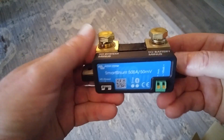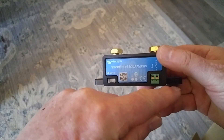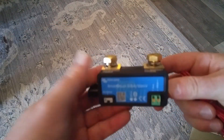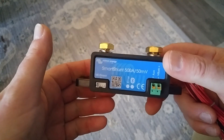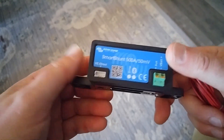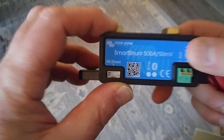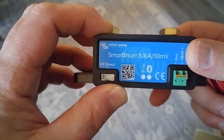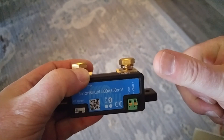It's compatible with lithium — really nice, future-proof in that way. So it's basically that simple. I'm going to pull all the wires off my negative terminal and put them here, connect this post to my negative terminal, take one of the little red wires that comes in the box and plug it to the positive terminal. Then I just download the app and I'm good to go. Really cool. It would probably take me a half hour to tell you all the features of this Victron Smart Shunt. If you're interested, just do a Google search on Victron Energy Smart Shunt 500 amps. But I'm really excited to get this hooked up, so let's get out there and do it.